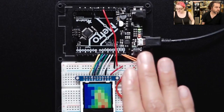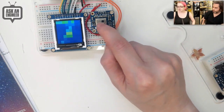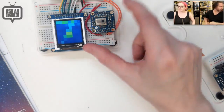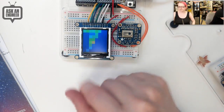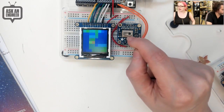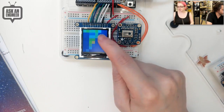On the overhead you can see the sensor — the little lens is in the very center. We have level shifting and power regulation on the board. I have it connected to a Metro Arduino-compatible board and hooked up to a 1.44-inch 128x128 pixel display, where each of the sensor's 64 outputs maps to a block on the screen. The sensor gives you a 64-point Celsius measurement in floating point, which we map to colors.